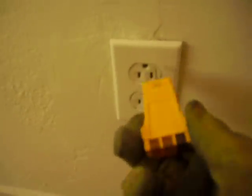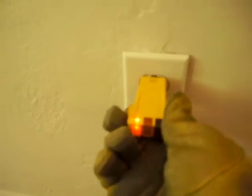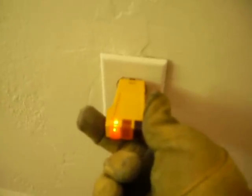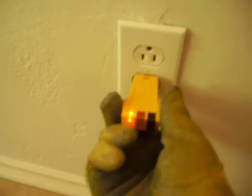This is a grounded outlet that's been installed. I've taken the adapter off, and I don't see this very often, but I see a single light when I plug into the grounded outlet. And that single light is telling me that we have an open neutral.